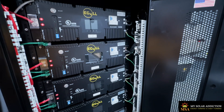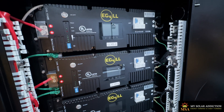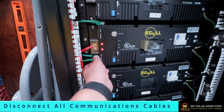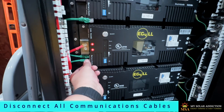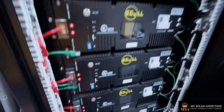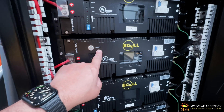As promised, I'm going to do a video on updating the firmware on the LLV2 so that they will work with the EG4 PowerPro all-weather wall batteries. Some people are concerned that they don't work. The first thing we're going to do is disconnect everything — every communication cable — because that could create a problem when doing this. We don't want to lose our cables. We already did this battery up here, so I'm going to do this one for you.